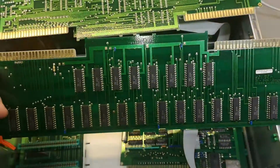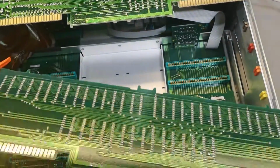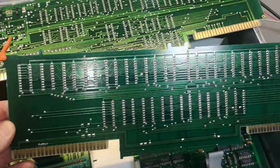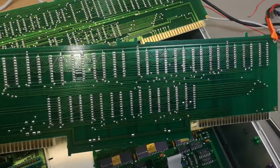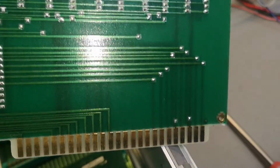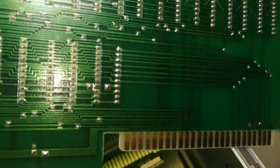This is a 2-layer board. It's also only running at 2 megahertz, right? But still, don't you just love this design? And those long wires. And this was before impedance match reflections and anything like that was a problem. See, there isn't even a ground plane or a return path on any of the signals.